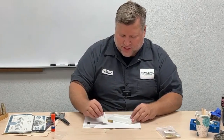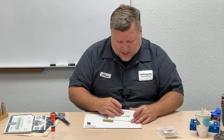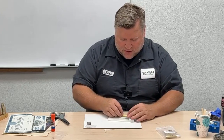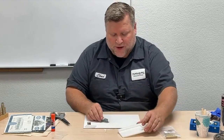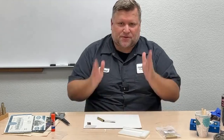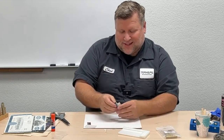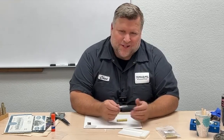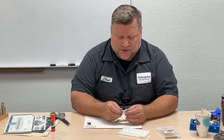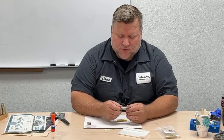Now, the rolling jig is nice because you can put the template cutout into the rolling jig. You'd want to have your glue on there, or if it was a sticky label, you'd put your tube in and then roll it, and that allows you to start square. So by using the rolling jig, you have a square start and you roll square. If you don't do that, it doesn't necessarily roll square. However, with the glue, you can't do this with a sticky label, but with the glue that I'm going to show you, you can kind of, with your thumbs, reposition it and twist it.